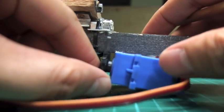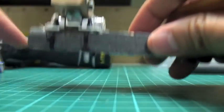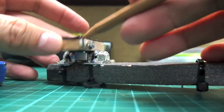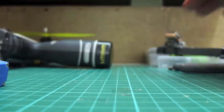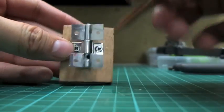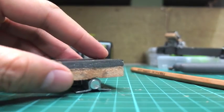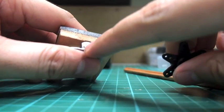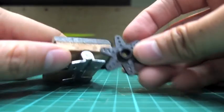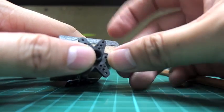Unlike the David Finderstill version, my servo was mounted on the underside, not the topside, so it was a push rod connected to the servo horn here, and that made it tilt this way. If you want to do the David Finderstill version, you can have your barrel bolt screwed onto a wooden base, with your servo horn mounted flush. The bolt must be mounted flush to the ends of the wood, and your servo horn would be placed this way and screwed there.